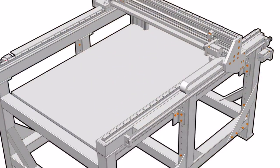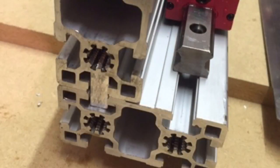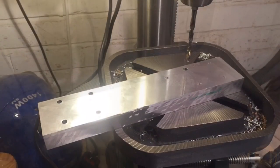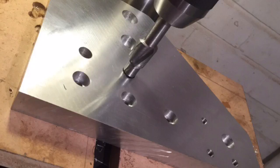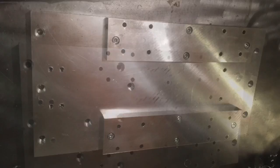The complete frame starting to take shape, adjustable feet for the bottom, the bed taking shape, some more serious drawings, starting to make the gantry, fixing the two pieces of profile together, mounting the rails, making a routing jig for making those end plates, starting the process of routing them. This is the first bit of aluminium routing that I did. That's the more or less complete band sawing — I think these are the little bottom plates that the gantry ends sit on. Counter boring, working out how the belts are going to work, starting work on the Z axis.